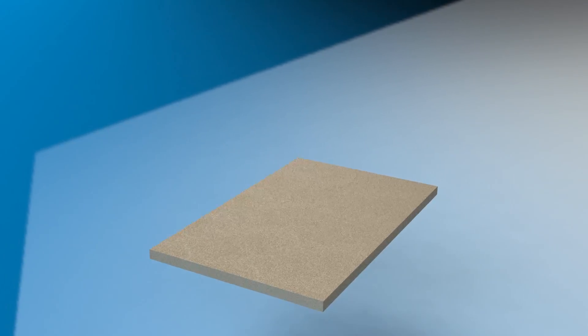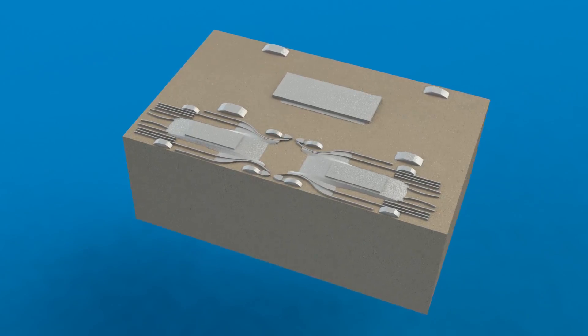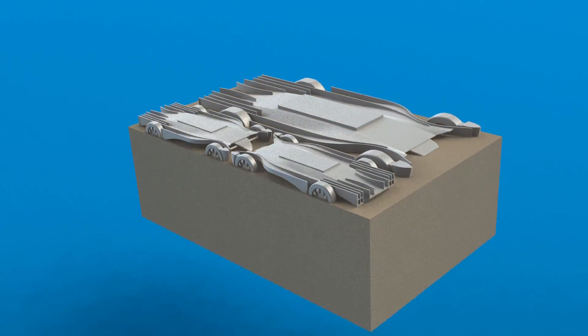The 3D printing process was a selective laser sintering process, which basically lays out thin layers of powder and uses a laser to melt only the portion of the layer which is actually part of the model. This has an advantage over other types of 3D printing in that parts can be unsupported during the production process.